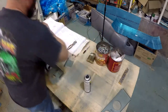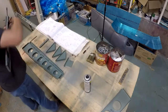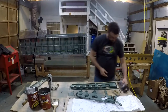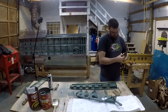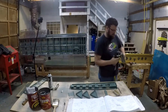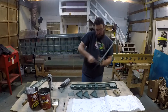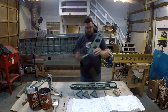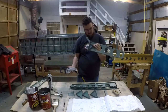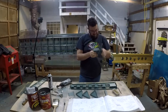Here you see me starting to put together those seat belt anchors I was talking about — these are the anchors for the seat belts on either side of your hips. It's just a matter of getting those two prongs together, and you want to go through and use a rubber mallet on a vise to straighten them out so they're flush when you go to put them together. There's an extra bracket or frame there that serves as another anchoring point.